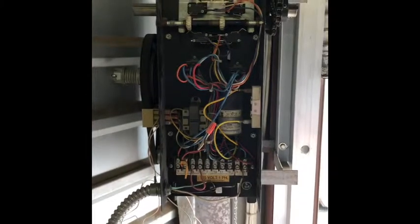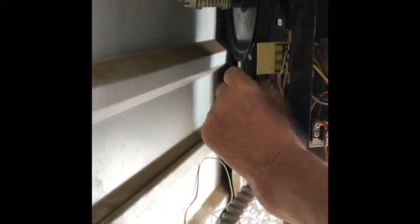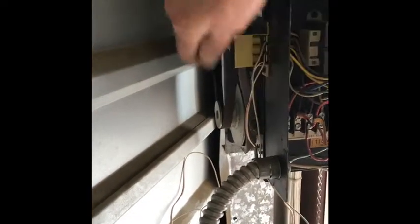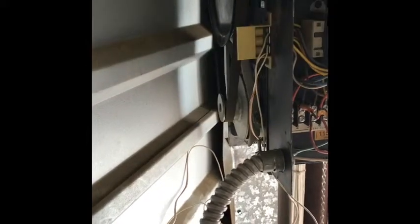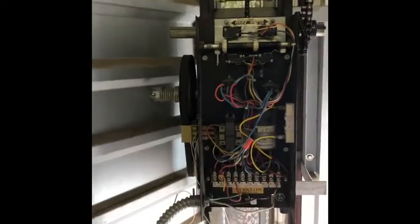Yes. Okay. And you know, when I got here, they were using automotive belts and they didn't have the little riblets on the belt. It was smooth, and that was a huge problem. These are meant to have ribbed belts because these don't tighten really tight, even when you're tightening them. So they need that for grip. Okay, and those are actual factory belts. It's just the right part for the job. I mean, it's common sense.